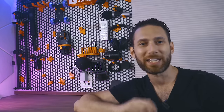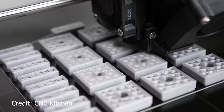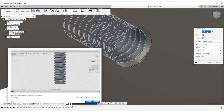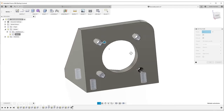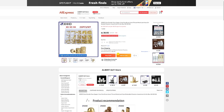For more information on heated inserts, I recommend checking out one of my favorite channels, CNC Kitchen, where you can see research on various types of inserts, which ones work better, tutorials on how to design and modify your parts to best accept the inserts, and even pick up some ultra high quality ones made by CNC Kitchen themselves. Though personally, I just used an assortment that I bought on AliExpress, which I will also link to in the description below. Personally, I only keep M2, M3, and M4 inserts on hand, and I've never really had a need for bigger or smaller ones.